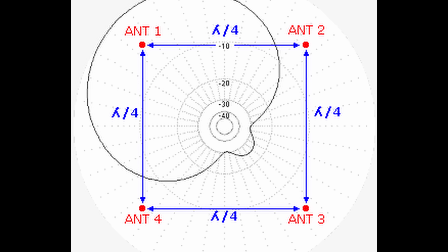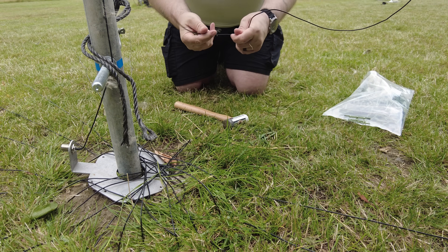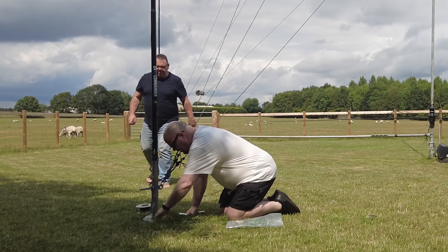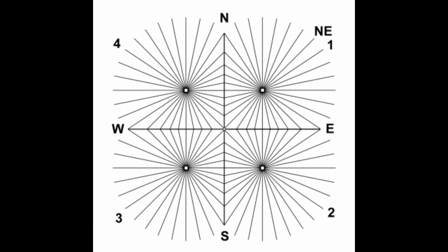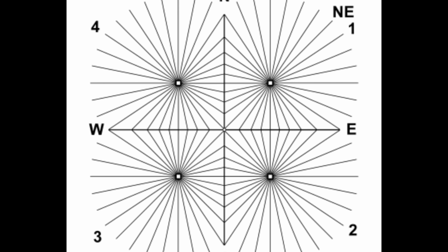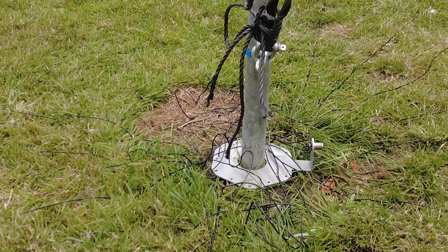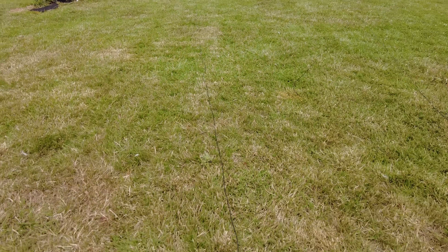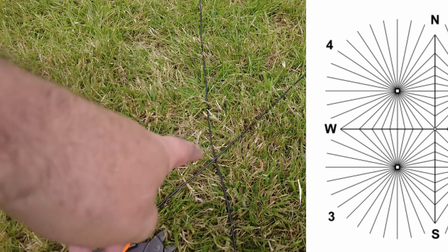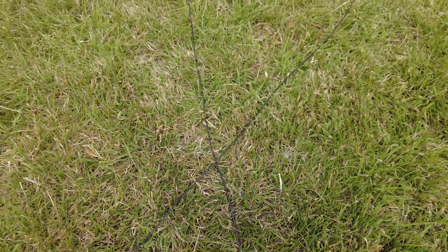It's off the diamond rather than perpendicular, so each vertical needs its own radial set. We've got seven-meter radials, 24 of them for each of the verticals. There will be intersecting radials — for instance, that's our southeast vertical, and if you follow this radial here you'll find it will cross over. Rather than trying to calculate everything, we'll just cut and join them.